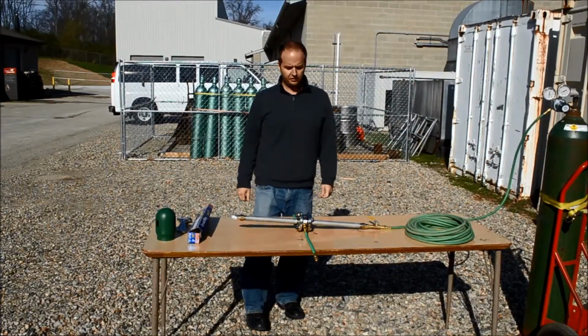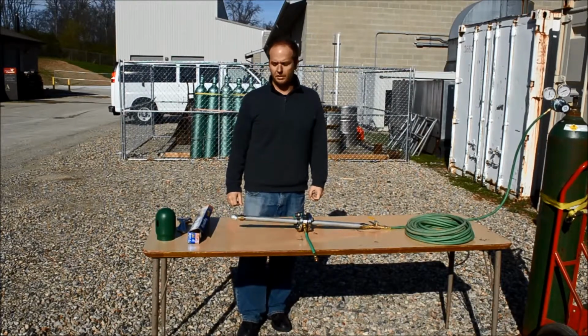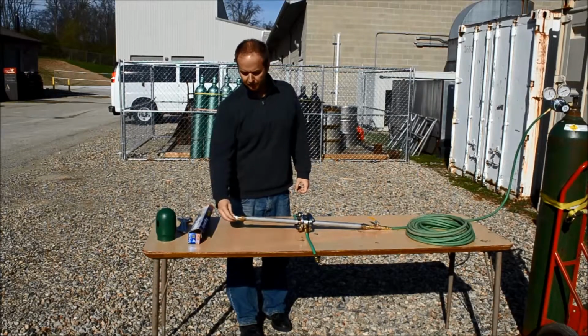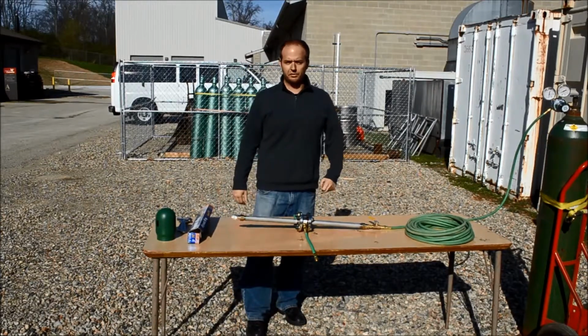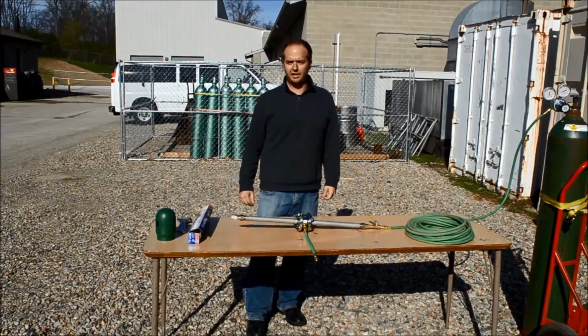After your test, disassemble all of your equipment and be careful not to get any dirt or debris inside. You can wrap aluminum foil around connection points to help prevent this. If, however, you do get dirt or debris inside some of the pieces, refer to instructions on how to clean parts for oxygen flow before you're running your next test. Following these instructions will help your oxidizer flow test go smoothly and safely.